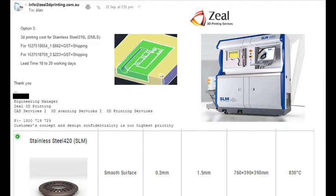For the final product, the inner green bit is going to be SLM 3D printed stainless steel at a very high resolution — nicer than SLA. Zeal 3D Printing in Australia has given me a quote for the insert which is very affordable, including detail stats as well as heat and durability stats that will survive the injection moulding process. This will be for final moulds for parts and kits that will have a longer production run.